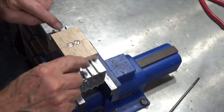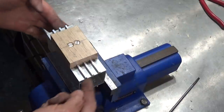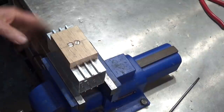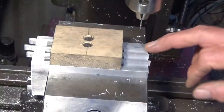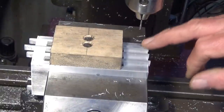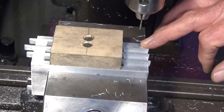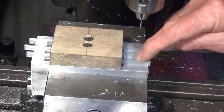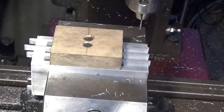And we're going to drill a single 1/16 diameter hole in each one of these metal bars here and right through into the square stock underneath. So let's go over to the CNC mill and get this set up. Now the G-code that I'm running here to drill each of the six holes for the rivets is a very simple point-to-point drilling operation. And the G-code just simply positions the drill bit over each of the six positions, and then I'm lowering the quill by hand.